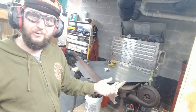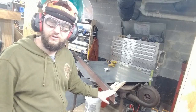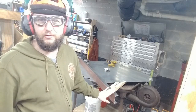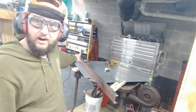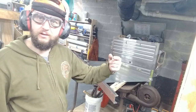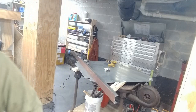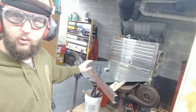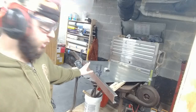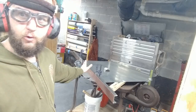So now it's time to clamp up this straight edge, just a piece of C channel, which is going to be a lot more straight than any wood that I have, and take a grinding wheel and just score that line in order to create the hinge point, or the bending point of the sheet. So now that I've checked, make sure that grinding wheel, when held up on the guard straight against the C channel, is right on the line that I want to score.